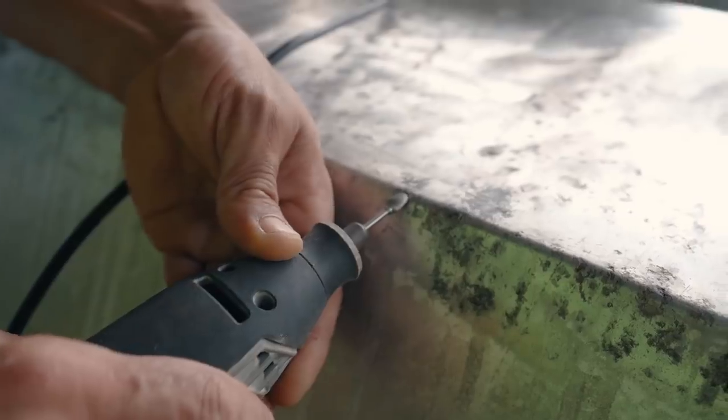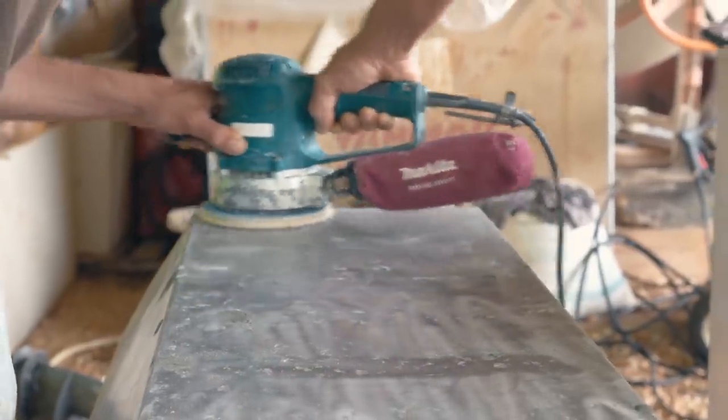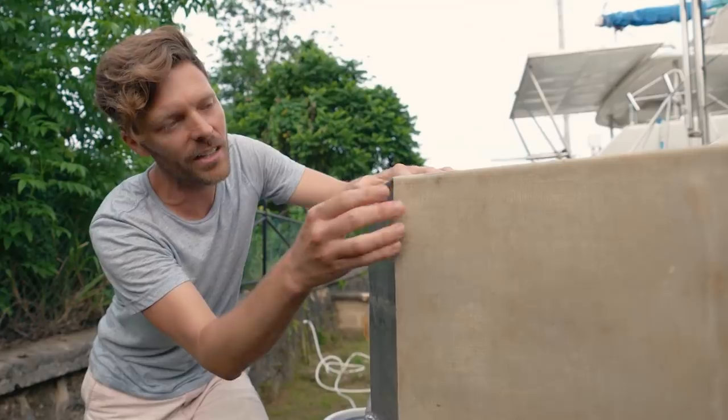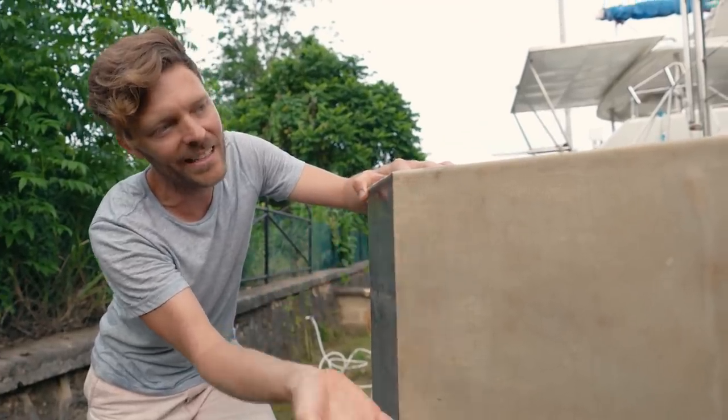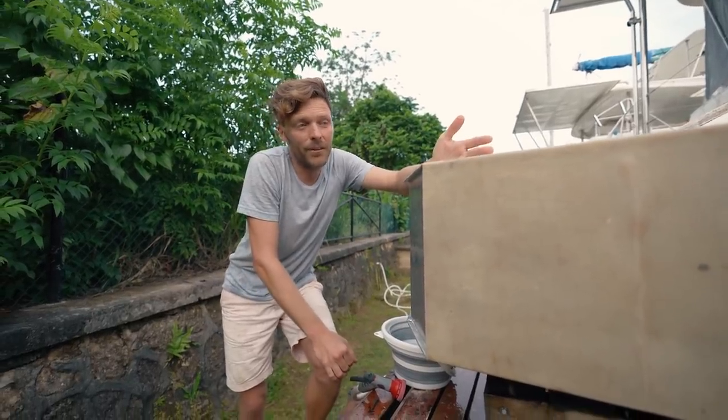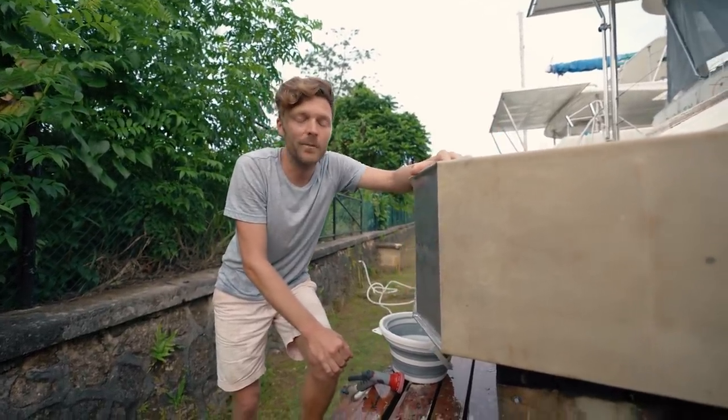Yep. Sanded the bottom, filled the holes with the steel stick. We sanded, cleaned all that stuff, put a layer of putty, and then fiberglassed just the bottom. We decided not to go around the edges because we were worried about bubbles causing the fiberglass to burst and then separating. We have friends that have done something similar, and theirs has lasted for 5 years. Hopefully we have the same luck as them.